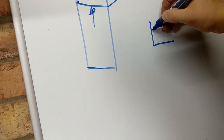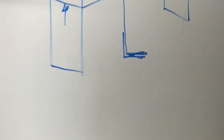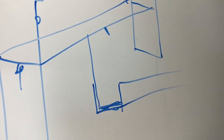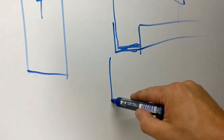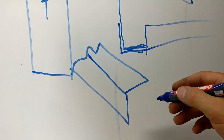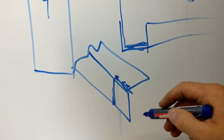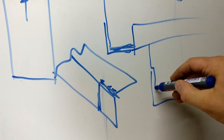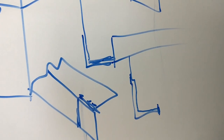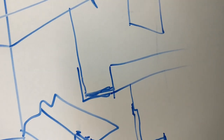We're going to have a piece coming across here. Now I don't want it to sit in there like that, because then that's going to make it difficult for the piece which then has to weld on there — that bit, the stretcher. So what I'm going to do instead is take that piece of angle, which kind of looks like that, and notch it out like that. Take a cut across there and a cut across there, and then it'll fit in there like that. It'll sit flush there, and it'll sit flush there, and you'll get a full weld across that piece there.